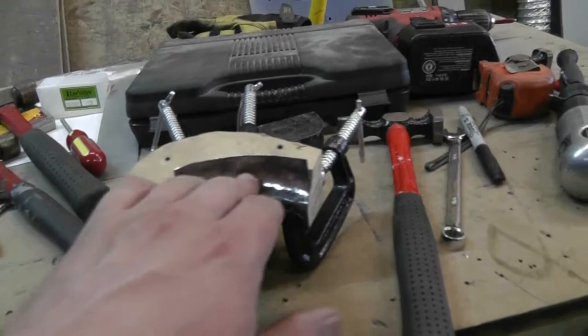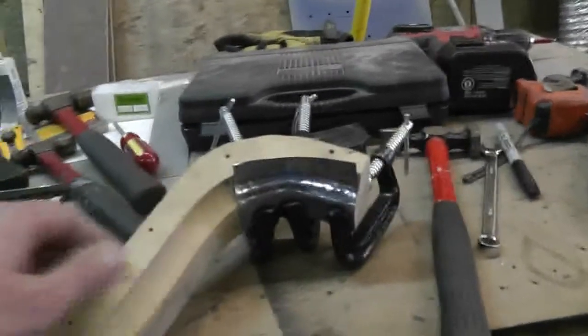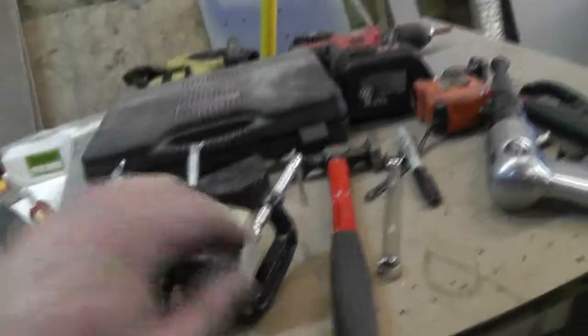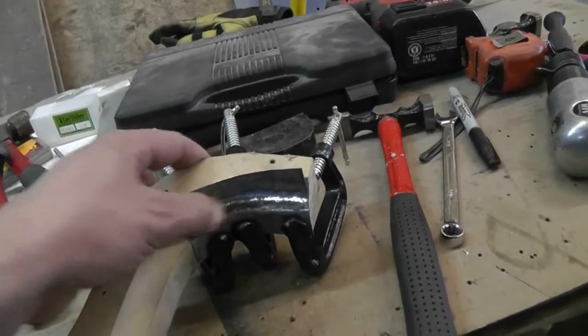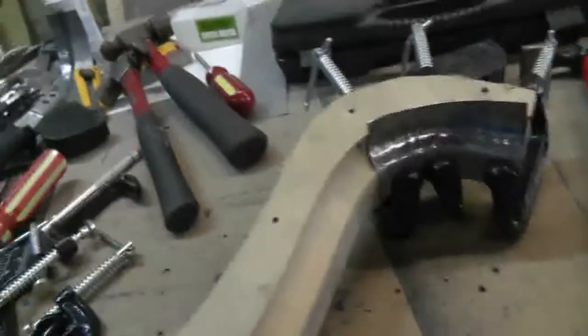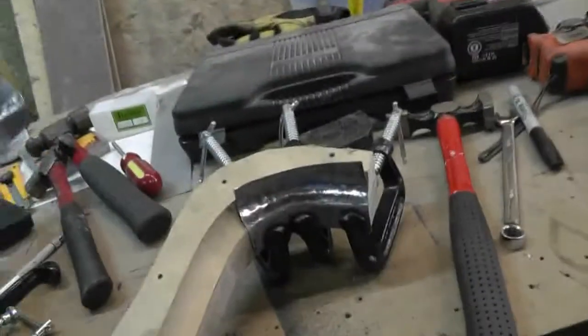I think this is going to work a lot better this way. Just a little bit of rough shaping with the ball peen end of the hammer, then planishing with the air hammer, and it's already better than this one was after hours of trying to shape it. So that was the way to go — I'll break this into two parts.